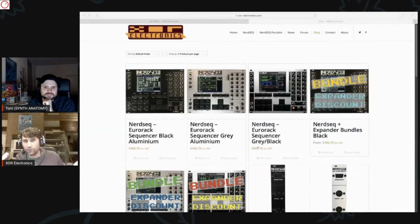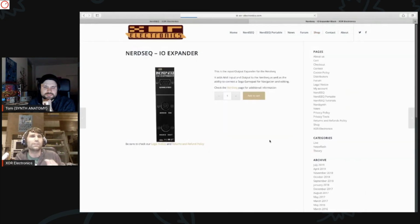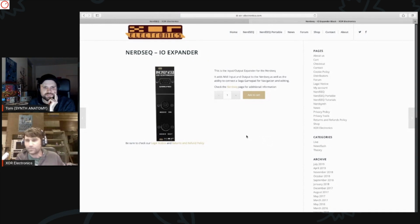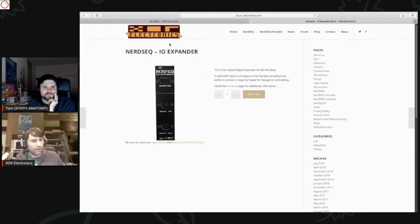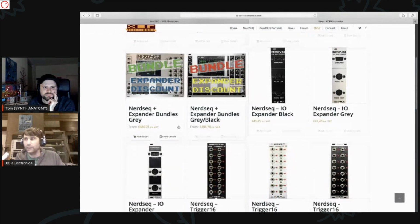The MIDI expander, so it's a MIDI in and output, with standard DIN MIDI. It has gamepad input, so you can control it with a Sega gamepad. You can navigate and start-stop patterns and stuff, mostly for live playing. And then for MIDI, it's like a MIDI input, polyphonic. You can record from MIDI. You can record into MIDI tracks. You can record into CV gate tracks. You can use it as a MIDI to CV adapter. And with the CV16 expander, you can also play polyphonically from a MIDI keyboard, and it plays the CV notes out there, polyphonic.